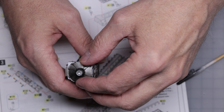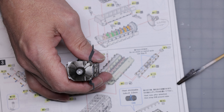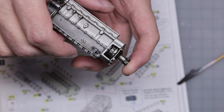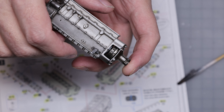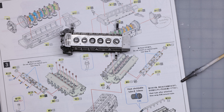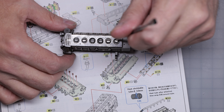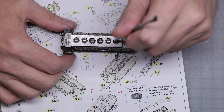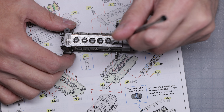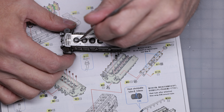This will drop in here like that — that's our clutch and bell housing assembly, and that's all you can see of it. It'll all assemble, it'll all be fine. Having the crank and pistons in there is a bit of a novelty. It's a bit of a miss because it really doesn't fit — you can see this piston is on a rod, but that's how much play it has. It can almost rotate like 30 degrees, so she's a little sloppy. There'll be a bit of blow-by, maybe a bit of piston slap going on. She'll be a little noisy, maybe not have any compression on a couple of cylinders.